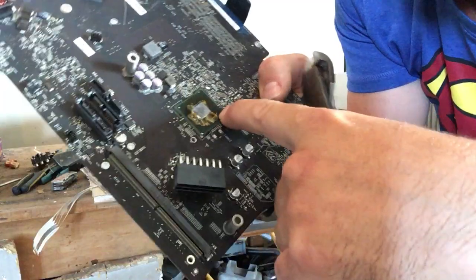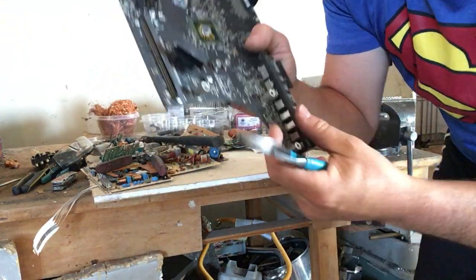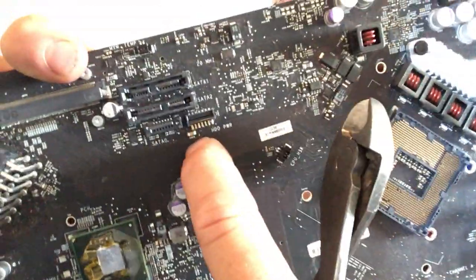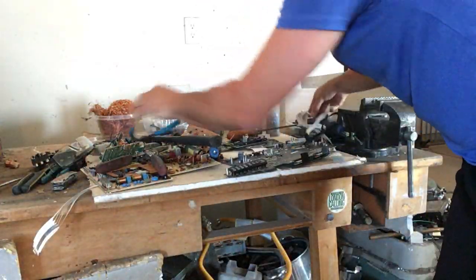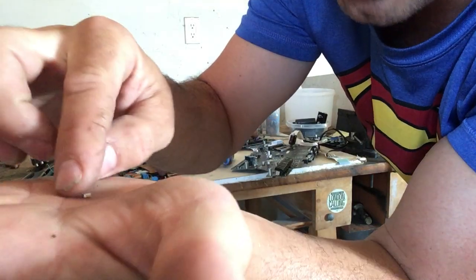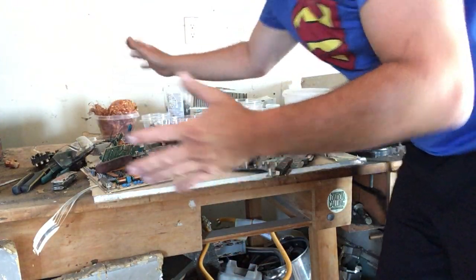You do want to make sure when it comes to heat sinks that you separate them — the non-pressed look is your clean 50 to 55 cents a pound aluminum, and your extrusion is the higher grade. Underneath that, another type of IC chip — same method, I just put a flathead screwdriver under it. This board also has a couple of really nice MLCCs. These are what can contain palladium. I take a flathead screwdriver and rub it underneath — it slides off. They're not huge, but given the palladium price, the precious metal in those is definitely worth it for some people.